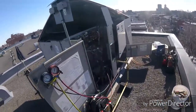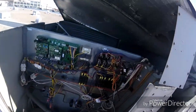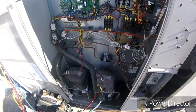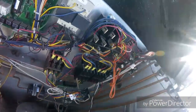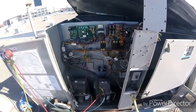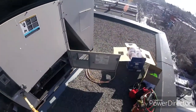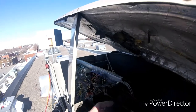So this is the setup. Compressor number one is dead from the leak on this side. We're recovering number two because it's going to end up leaking too on this side. We're going to put some strut and clips so this doesn't happen anymore. We're recovering the second circuit and we're going to use half-inch pipe to make a nice connection here with a bend.